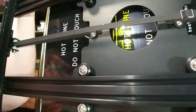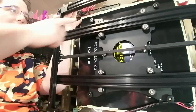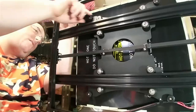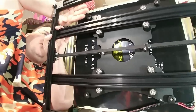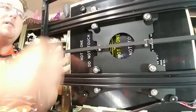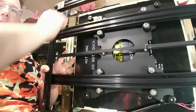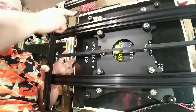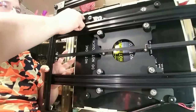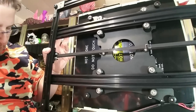The Y carriage is actually pretty small relative to the bed — there's not much room to reach the leveling knobs. You're going to have to reach in underneath, and it'll probably require lifting a corner of the printer. They're nice knobs, just too far inward. My suggestion: add five bucks to the cost and extend the Y carriage so you can reach the knobs from outside and fit larger wheels on them. We'll see how well it holds the bed level.